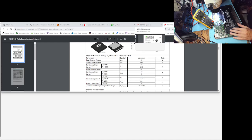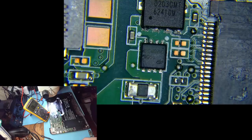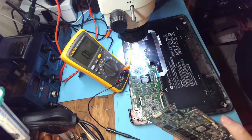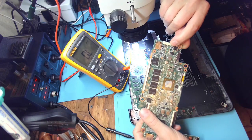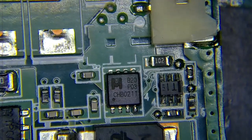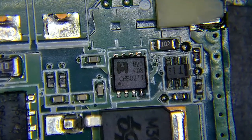I have another MOSFET from another board. It's a different MOSFET, so let's look at it under the scope. This is our equivalent of the MOSFET on that other board — our big MOSFET and our small MOSFET. But this one is B20P03, meaning 20 amps, 30 volts, and P-channel. So this one will not work. That's why the BQ chip on this board works with a P-channel MOSFET.